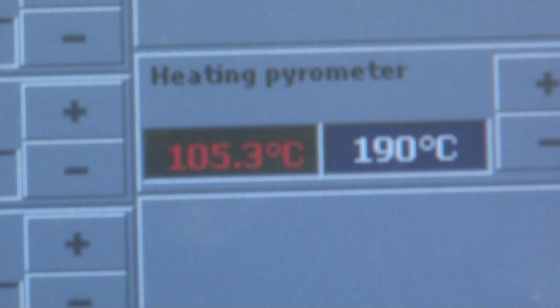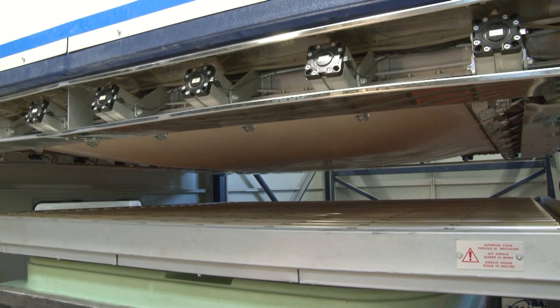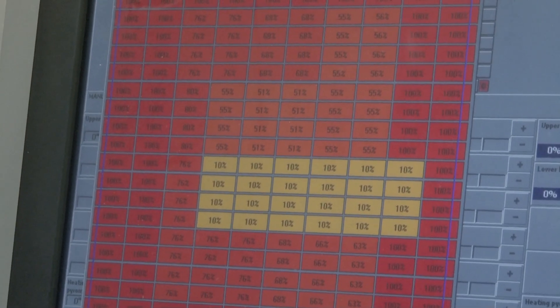It's lifted by the machine, and the infrared heaters heat it further to 190 degrees. As it heats up, the sheet grows softer until it gradually swells up and collapses into shape.